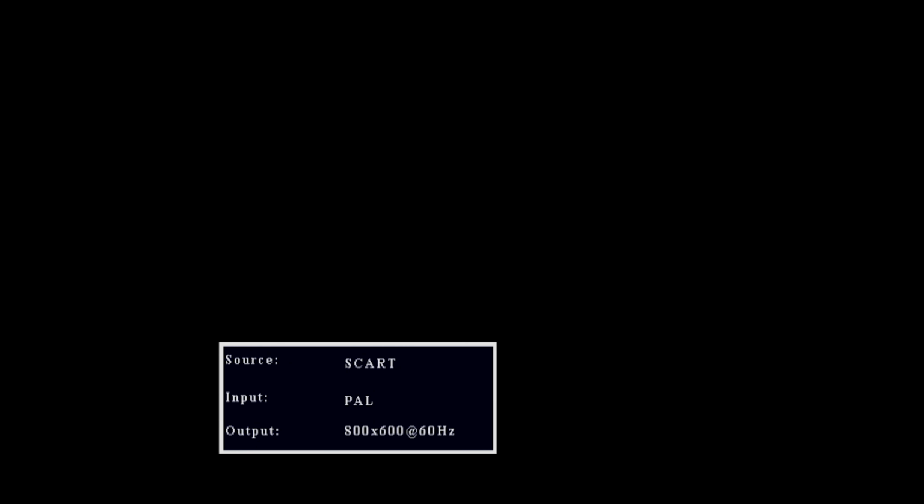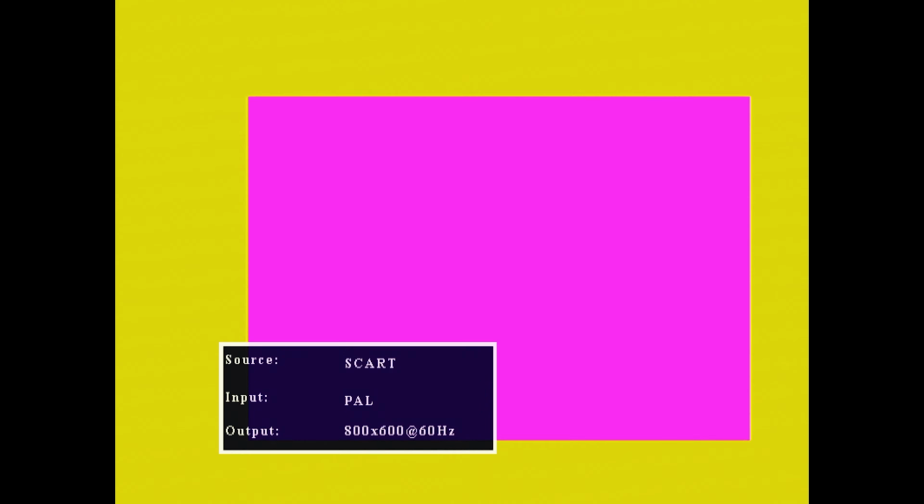It's like the blocky graphics are working, but none of the pixels, if that makes any sense. This is normally filling up with all kinds of dots, but it's just blocks. Just blocks and blocks. It seems to be running perfectly. It's executing code. It's outputting graphics. It was beeping and everything. So this is a really unique failure mode I've never seen before.